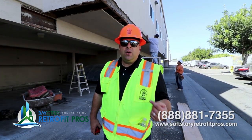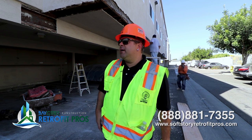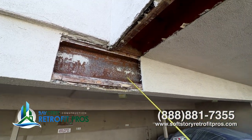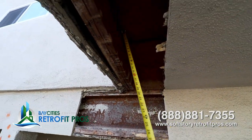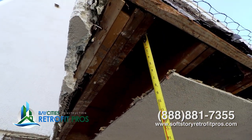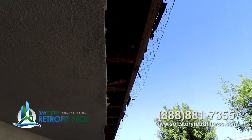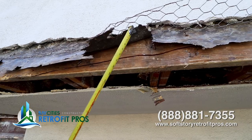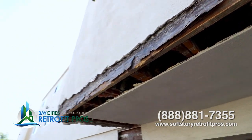We're on the other side of the building now. We're taking a look at the cantilevers over the garages — we were expecting to see some termite damage caused by maybe a window leak. We opened it up to get a true understanding of what's going on. This is what we consider the dragline beam — it's an I-beam. Above it is a top plate, and then you can see this is a cantilever 2x12. See how it's all twisted out? This is caused by torsion. The connection between the floor system and the rim is bad all the way along the entire line — pretty much it's separated. This little section actually cracked out — that's basically a failure of the rim. The guys were trying to save nails back in the day; it's got maybe two nails where I'm holding it up.